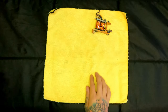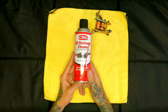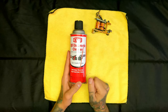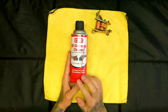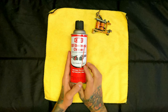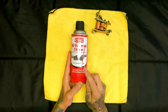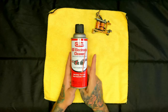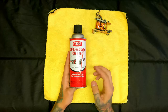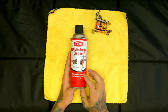You need your machine and some sort of cleaning agent to clean off the carbon buildup. I don't remember where I found this product but I know it was from a machine builder — this QD Electronic Cleaner. This stuff is amazing: it takes all the carbon residue off, takes any sort of oils off, and it evaporates really quickly so you don't have to worry about residual left on there — it'll just evaporate away. The only thing is this will strip any sort of lubrication or oils you have on there, so if you use this stuff you're gonna want to apply some lube back onto the springs.